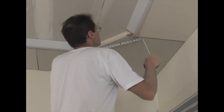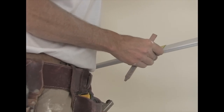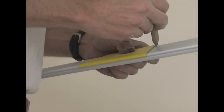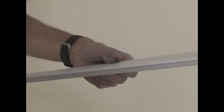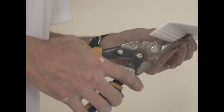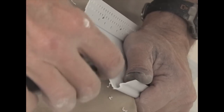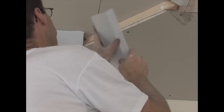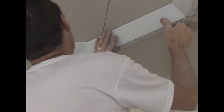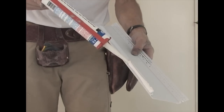This ceiling has angled corners. The longer pieces have been attached and have square end cuts. These short pieces will have angled cuts. Use the Trimtex miter marker to mark the correct angle. Cut with tin snips. Bevel the back angled edges with a utility knife to create a tighter fit. Dry fit to make sure you have a nice fit. Use spray adhesive and adhesive caulk and attach the final piece of the Easy Tray.